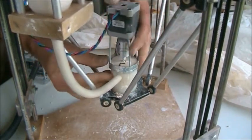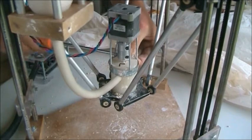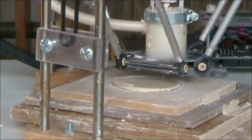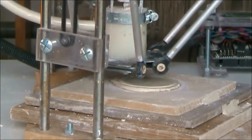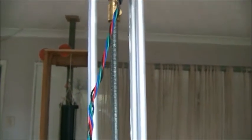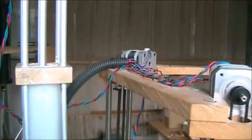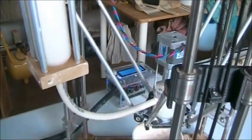I consider the RAM as clay delivery — it offers the clay up to the screw that actually controls the extrusion. I've designed these printheads to come apart as easily as possible for cleaning. It gives an indication of the speed that the RAM is turning at. The whole system is counterweighted, and it obviously needs to be able to move back and forwards but also up and down with homing.